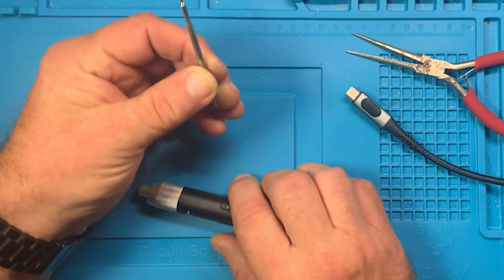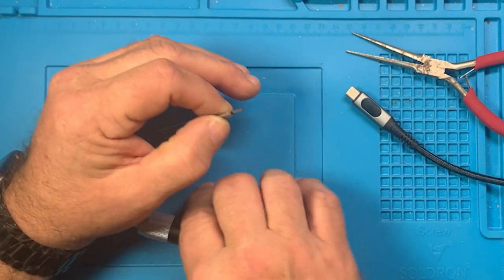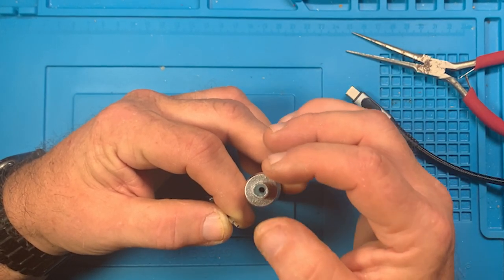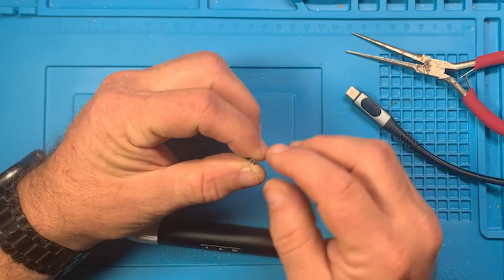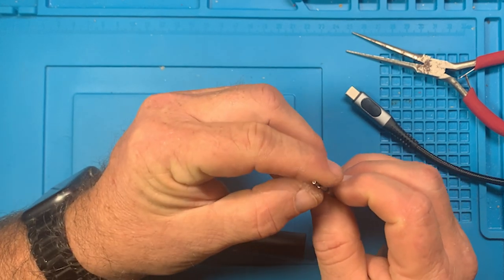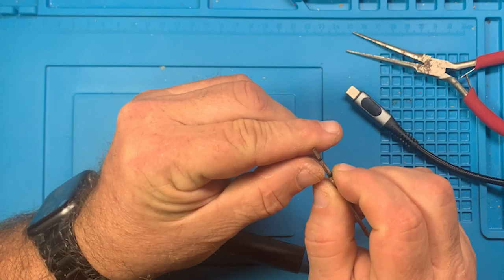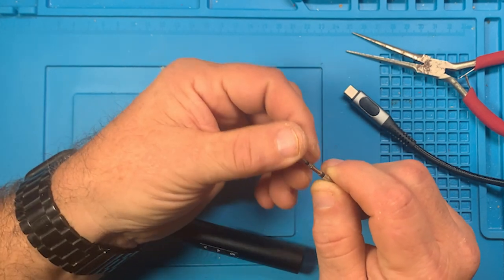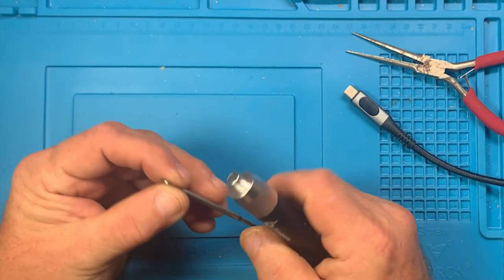Without a beveled intersection and a guide that perfectly aligns like the other ones have, where the tip goes straight down into place and seats, this is not ideal. I'm not telling you to do this because I don't know if it would cause any problems, and I don't think it would, but just for this one, I would be tempted to take this tip and work it on a whetstone or something and round that shoulder just a little bit, so that it's not such a flat, sharp shoulder. I think it will help get that tip properly seated in there.